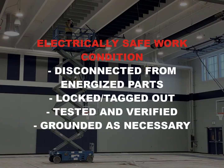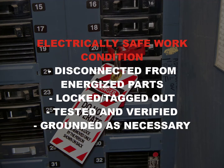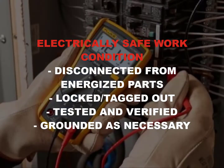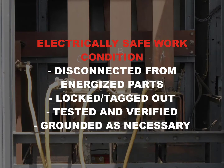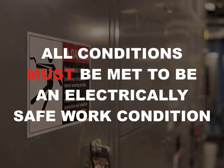By definition, an electrically safe work condition is a state in which an electrical conductor, or circuit part, has been disconnected from energized parts, locked and tagged, in accordance with established standards, tested to verify the absence of voltage, and, if necessary, temporarily grounded for personal protection. To be compliant with the standard, all three of these conditions must be met.